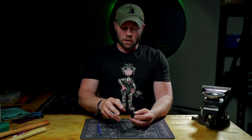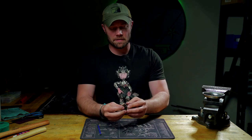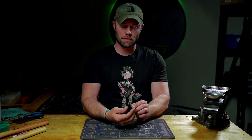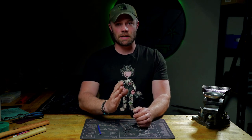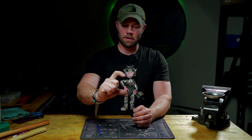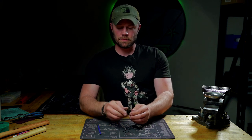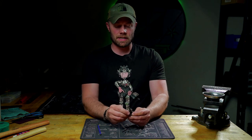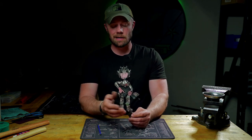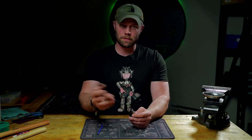Making this area skinny also accounts for times when barrels are dimpled for set screws at the factory and it's not quite perfect at the six o'clock position. You might need to index the gas block ever so slightly left or right because the dimples and gas ports are usually cut at the same time. If this top section were fatter and sitting at a slight angle, the chances of the gas block contacting the rail are higher — so we kept this area slim to ensure plenty of clearance once installed.